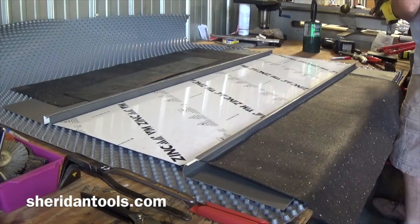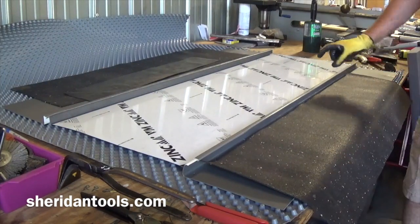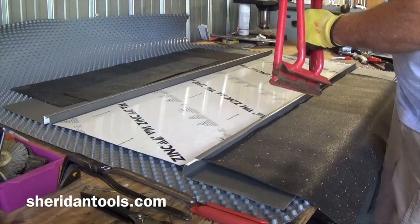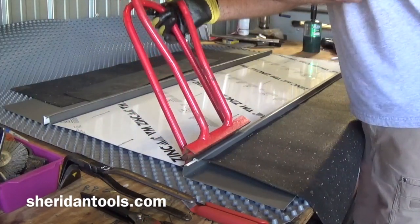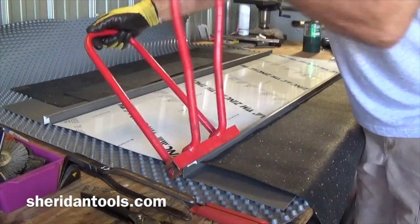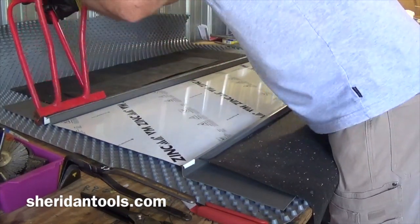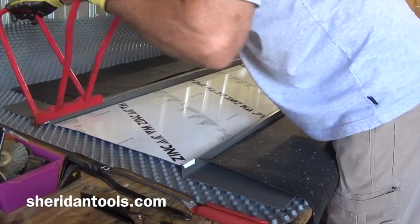Then one more process, you gotta close the seam. Again, there's 3 possible ways to do that. One is to run a mechanical seamer. One is to use standard ROW or Stubai or Wuko tools. So you can take the Wuko tool, use that. Alright, that completes your double fold. Again, if you feel the need to try and protect this, now's the time to put a piece of rubber over that seam.